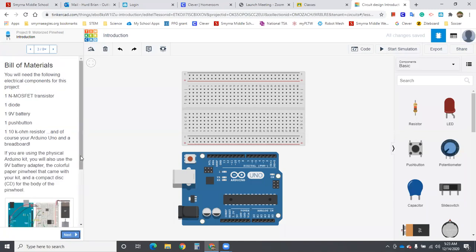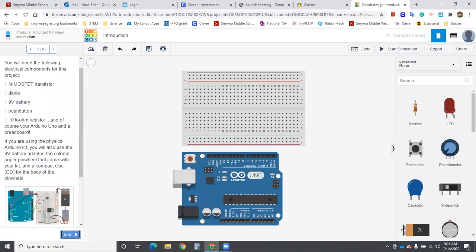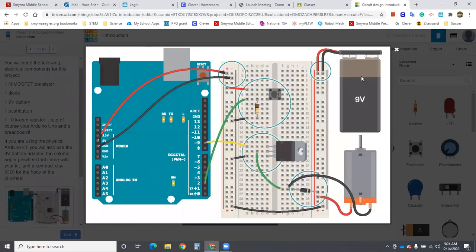Here's what we've got to use — not too many things — and the motor. This is what it's going to look like when we're done. We've got a 9-volt battery providing current to one side of the breadboard, and the Arduino providing 5-volt electricity to the other side. We do connect the grounds together, but not the positive rails — 9 volts is too much for the smaller components. The motor is on the 9-volt side because it needs 9 volts to power it correctly.